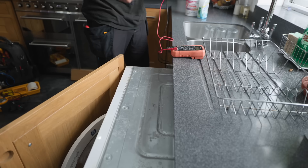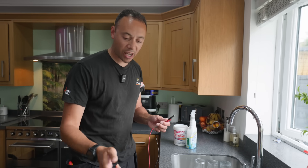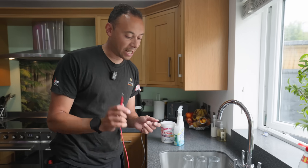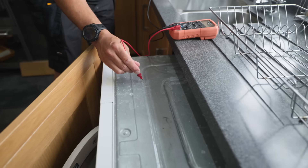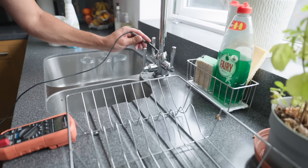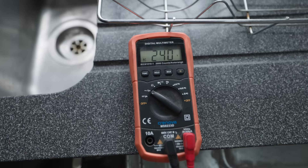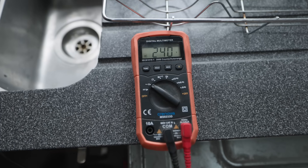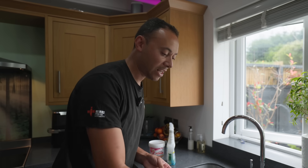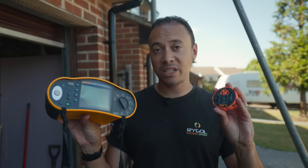The system's all connected and there are no obvious signs of anything being wrong at this stage. Now I'm going to show you how the voltage flows. Imagine being a plumber — I put a spanner down on this washing machine. Touching it alone isn't enough, but now imagine I'm doing some pipe work on this tap at the same time. If I put one probe on the washing machine and the other straight onto the tap, you can see on my meter I've got exactly 240 volts right there. Touching the washing machine and anything earthed simultaneously is exactly when current will flow straight through your body.